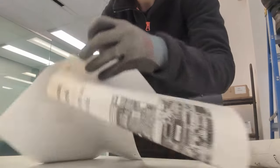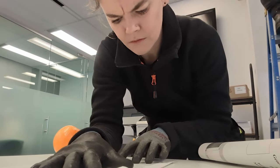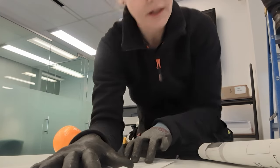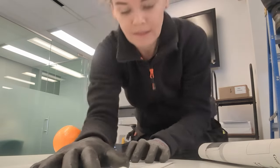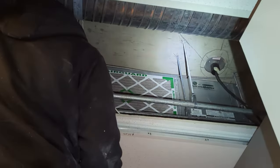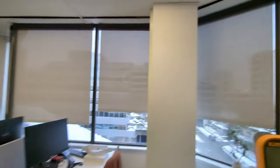We had another unit that had an LP fault in memory. So we did a bit of a leak test — unfortunately this is an old R-22 system. It just shows LP fault in memory, no leaks found. So this is slated for a replacement. I'm just making sure the heat works in this office before we leave.